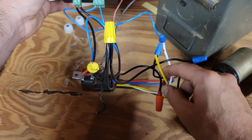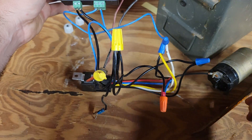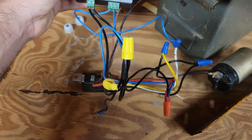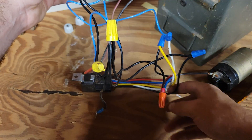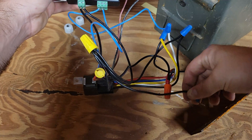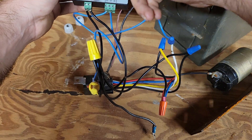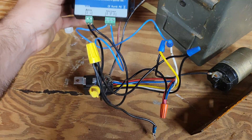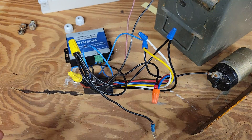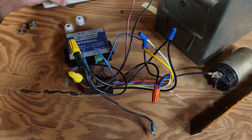From the relay, if you use the yellow wire, that's going to be your power source to whatever pool solenoid you have. The white wire is going to go to normally open. The negative is going to be the black wire. Your solenoid has to be grounded somehow, and then the negative on your GSM relay as well.